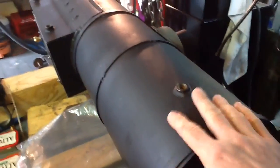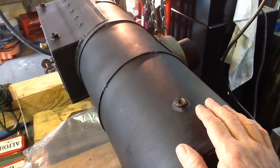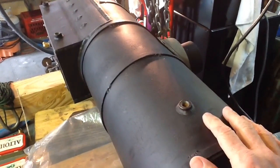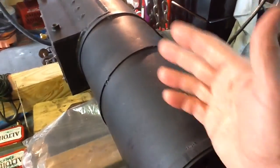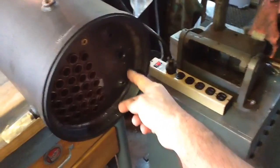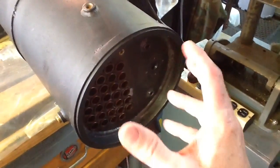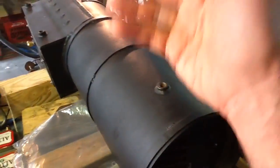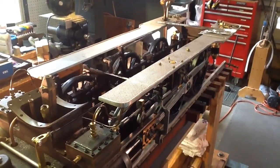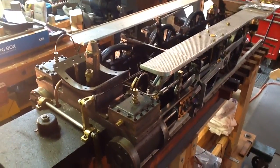My game plan for the boiler itself: get the boiler jackets and bands finished, put the handrail things in place, and then I can tip-set the boiler up like it's supposed to be. Then all the stuff that goes inside - the throttle, the throttle arm, the block, the header - all that gets installed. Once that's all ready, I can hoist the boiler up and put it in place on the chassis, then spend some time getting all the final piping done. That's today's update - thanks for watching, I hope it's useful and I'll keep you posted.